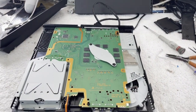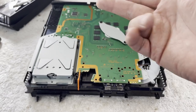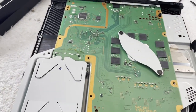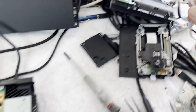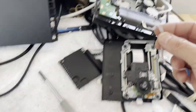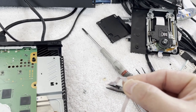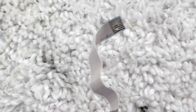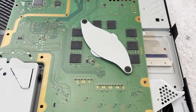We are back out in the garage and I think we're ready to test. I have its original power supply back in there, and the hard drive we were trying to install software on. I don't have the Blu-ray drive in there. I think I found out why it was acting like there was a disc in it all the time — I noticed this cable, which is the one for all the micro switches, was all chewed up and wedged in the Blu-ray drive. Something is short across the contacts — it's almost like a screw went into it. So something was shorting it, which is probably why it was acting like there was a disc in there.